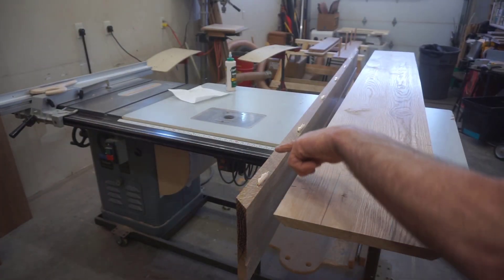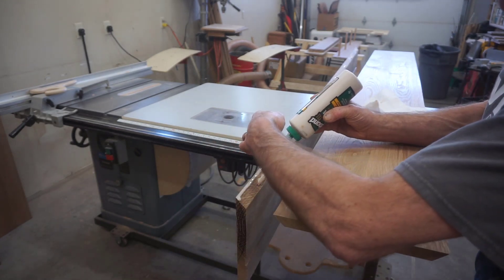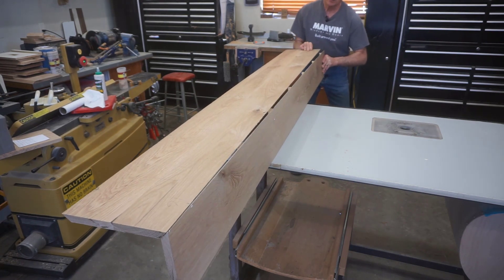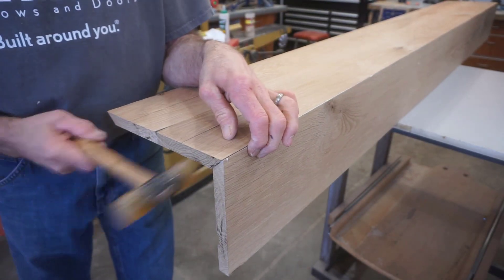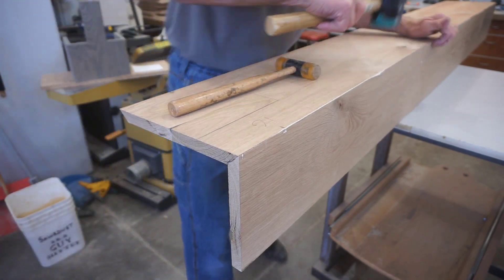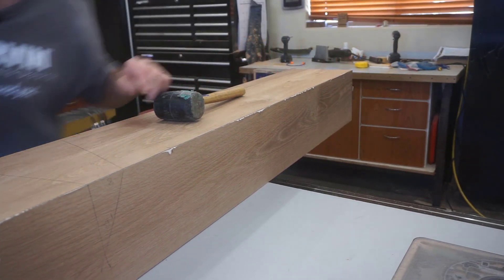The next step is to add a full-length bead of glue on the side piece right at the sharp point of the miter. I'm wiping the tip clean using my finger as a guide and laying this flat bead of glue right at the tip of that long point, because I want this miter to seal up tight so that it doesn't show in the finished beam. This would be infinitely easier with a cameraman. At this point the biscuits serve to line up the joint as it comes together — a lock miter would be pretty tough to do by myself, but as it is that miter comes together wonderfully. I've pre-cut these pieces to length so I can use the plastic mallet to line that up perfectly, and then I'll bump this joint together to prime it and you'll see that little bead of glue pop out of the edge. That little bead of glue popping up tells me that the finished joint will seal up nicely.